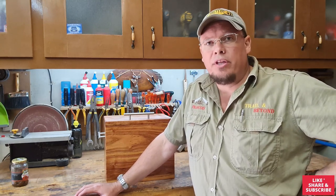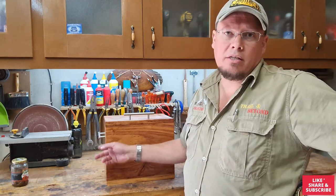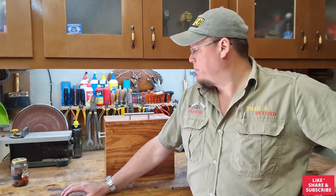Thank you for watching. I hope you've enjoyed the video. Feel free to leave a comment below — I always read the comments and like to engage in discussions with you guys. Just something to keep in mind: a lot of people cut their miters on the table saw with a sled, but a mitre saw is designed to do proper miters. If your mitre saw isn't dialed in properly you'll struggle to get accurate miters, but once you've sorted that out it's much easier than a table saw. My mitre saw can cut 305 millimeters of width, which is more than enough for drawers or small boxes like this. I'll see you on the next project. Thank you for watching, stay safe out there, and I'll see you on the next one. Bye-bye.